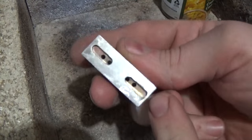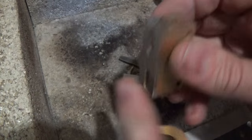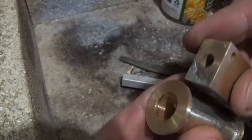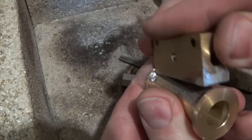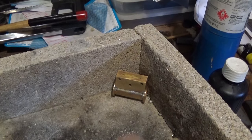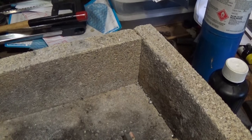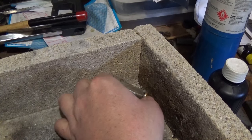So I've tinned them up and I've cleaned all that white-out out of there. I've given them a file up so they still fit pretty nice — there's no gap there. Next job is to sit that somewhere near the middle. We'll sit that over there so that it doesn't actually fall apart. Run a little bit of Spirits of Salts on both pieces, being careful not to get the holes blocked up.